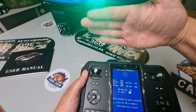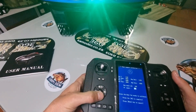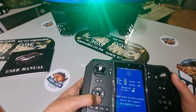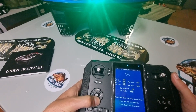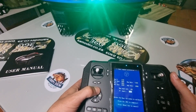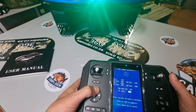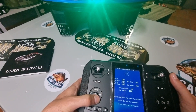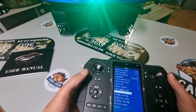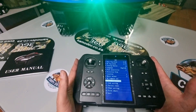If that arrow was showing left, right, or towards you, you can use the up and down arrows to change the angle of that arrow — you can see it turning. You compensate for the deviation of your compass that way, using the up and down arrows until it's pointing in the direction the boat is pointing. Then say okay and the compass should be calibrated.